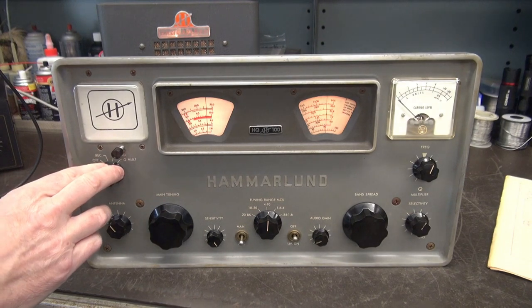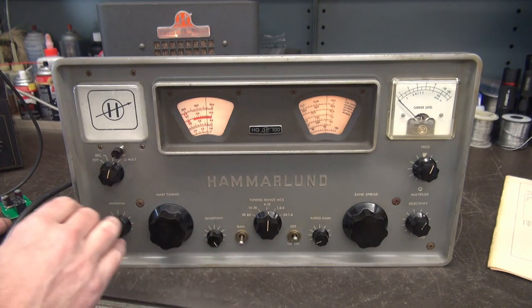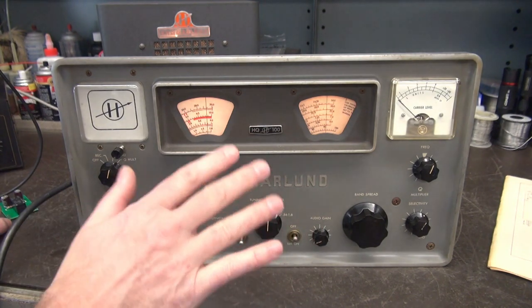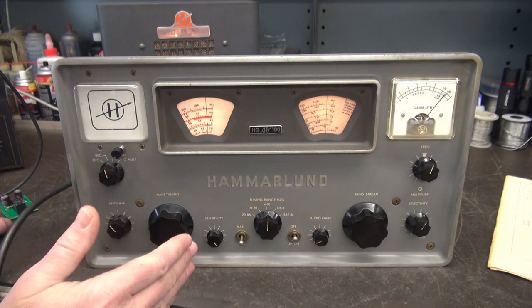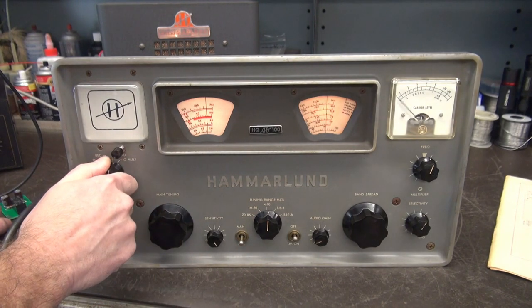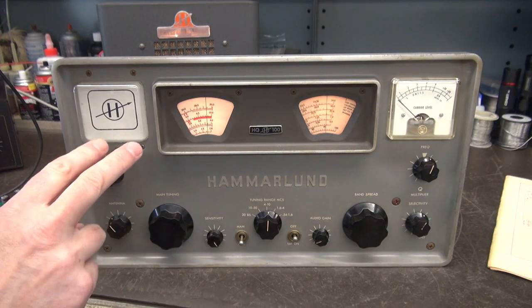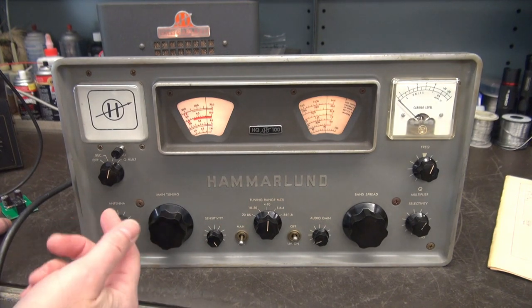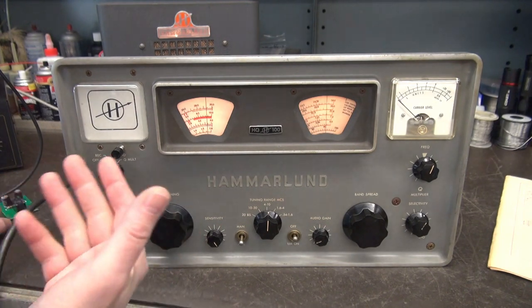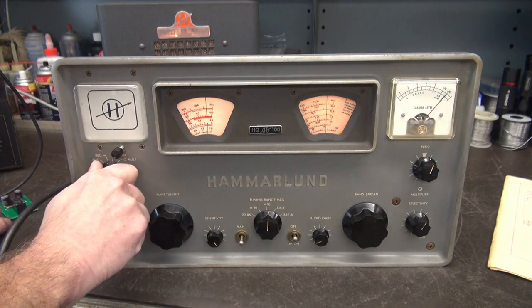What that's actually doing is turning off the high voltage in the radio, so all the circuits lose around 300 volts DC. Then when you go back to receive, it reapplies that voltage. On most receivers, when you're toggling receive and send, there's an external set of contacts on the back of the radio where you can hook into a TR switch or some other device, so when you key your transmitter it does this for you.